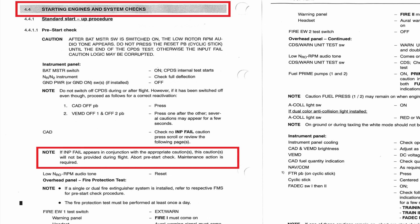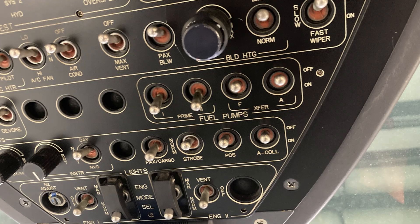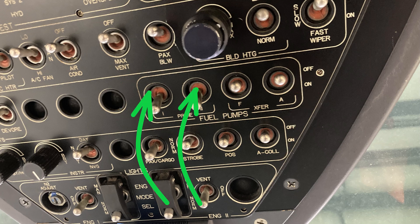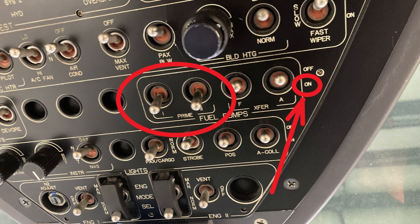So if your pilot gets this problem, he's going to call you. What you're going to say to him is: go ahead and look in your overhead switching panel and tell me what position the fuel prime pumps are in. If the fuel prime pumps are on when you power up the aircraft, you may get this caution. So just say: turn off your prime pumps, turn off the helicopter power, and then repower it up normally and follow the checklist — follow the flight manual.